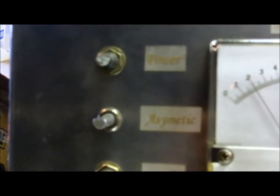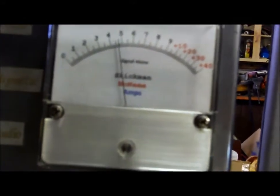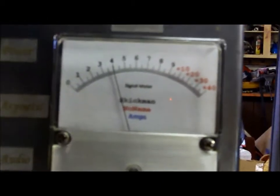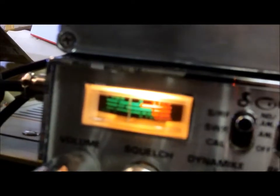It still has two more knobs — one is tube emulation and I can't think of the other off the top of my head — but I've already got them preset and don't need to adjust them from the outside. My power supplies are built into this box, which I built back when I first got the unit. I also built an S-meter that hooks right into my 29. It's a powered circuit that feeds off the receive section of the radio, reading the same thing as the meter in the radio.